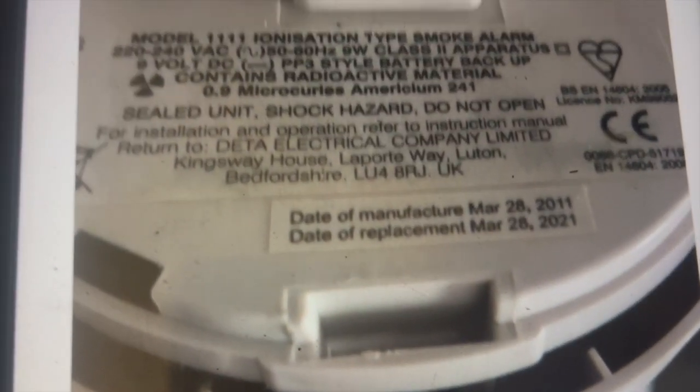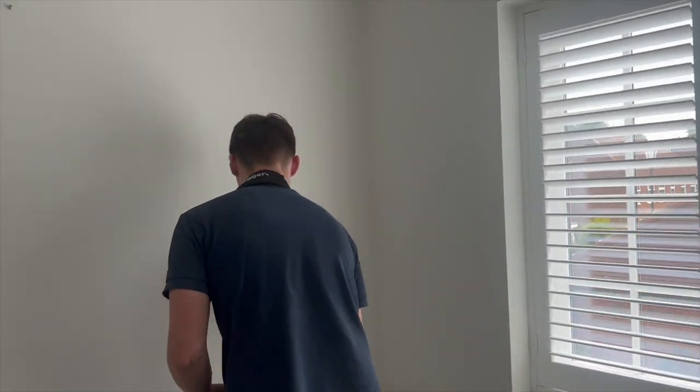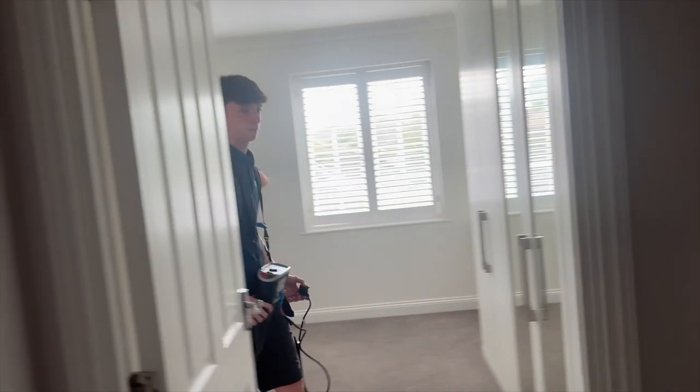We check each smoke detector and take photos because these are out of date. These smokes must have been a year or two old before they were even installed — and they've got broken bits. We're doing the R1+R2 checks, which are invaluable: they tell you if there are any loose connections, if a socket is accidentally on another circuit, or if any foreign cabling like speaker cable has been used. We also noticed what looks like it was once a tubular heater circuit — probably worked as an airing cupboard setup.